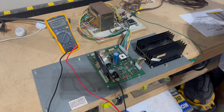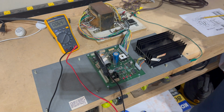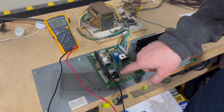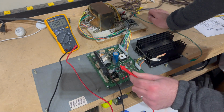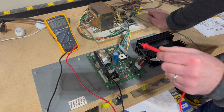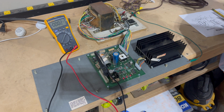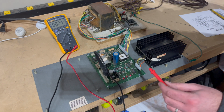That's plus 12 volts unregulated, so that won't necessarily be right on the spot. I did go ahead and re-solder in that C14 that we had pulled out because it had a cold solder joint and was kind of in the way. So at test point 5, we get 13.77, and that's okay because that's an unregulated voltage. 13.77, that looks good. And down below, test point 6, we should get -12 volts unregulated. Oh,